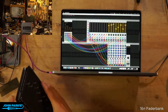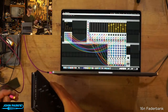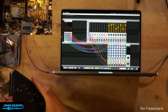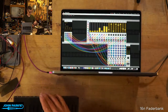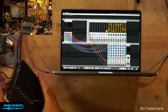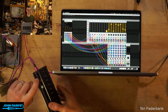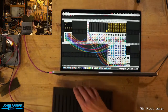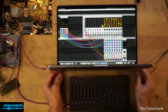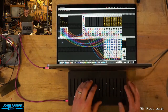By the way, if you like to fix stuff, be on the lookout for broken versions of this, because it has a little micro USB controller on a Teensy there, and 9 out of 10 times when someone has a broken one, it's because this has been, whoops, ripped unceremoniously off by accident due to the USB cable and something dropping or getting yanked. So if you're comfortable transplanting a USB connector or a Teensy, you can sometimes get these broken ones and fix them, which is what I did. And I actually have a couple others coming to fix for a guy who was asking about that.